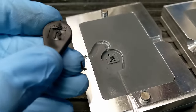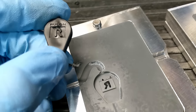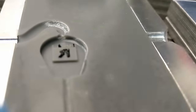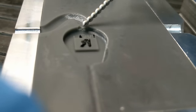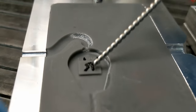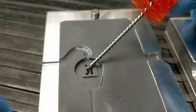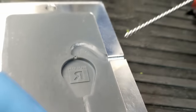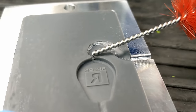I've been experimenting with polypropylene at low temps — 320, 325, 340°F — and we're getting lots of warp. You can see the injection gate is starting to chip away, probably just fatigue from the heat. This part design doesn't have enough draft and the detail is too deep and fine, so it keeps grabbing the hot material. This new one we did is much more shallow — it's demolding fine and holding up much better, though you can see a little fatigue at the gate.